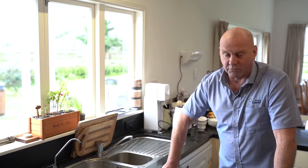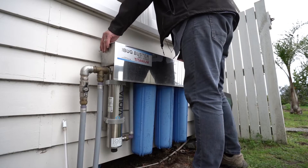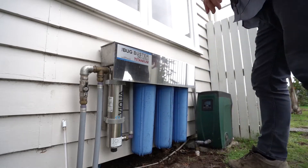We don't have that problem here because we're in the country, but our water is not treated by the council — we have to treat it ourselves because it comes from a bore on the farm next door. Most rural properties will be from a bore or from roof water, either their own bore or the farm next door's bore. We store it in our own little tank and pump it into the house through an ultraviolet filter. A lot of people don't bother with that if they've got bore water, but we do because when you've got stored water in a tank, you can get bacteria growing in them.